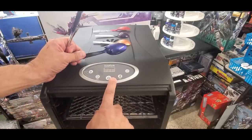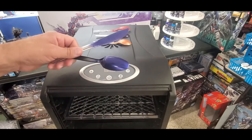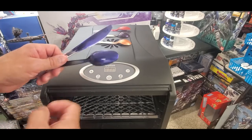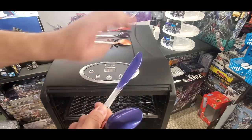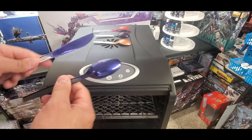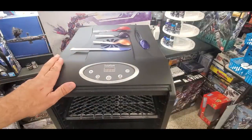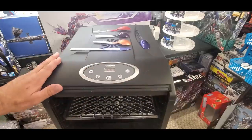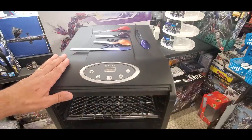For enamels I'd drop the temperature to around 98 to 100°F and let it go for six to ten hours for a full cure. If you add Japan Drier — just a couple of drops — it will speed up drying considerably. But honestly, it's already pretty dry — I'm rubbing on this and it's holding up well. That's the simplicity and awesomeness of having one of these units in your work room. I'll put a link below — it's around $110.